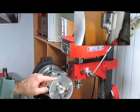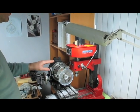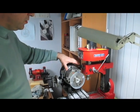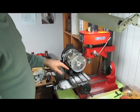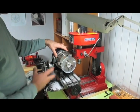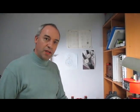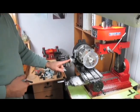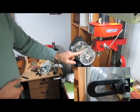I'm going to mill those 650 waves serration here on the circumference. I've already started. The rosette is set up on the dividing head, which is this big piece here, and it's clamped on my milling machine. You can see the head is quite big compared to the milling machine, but it still works. I had to make a special division plate here for these 650 serrations.